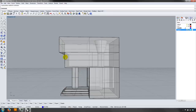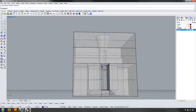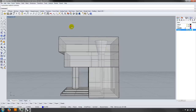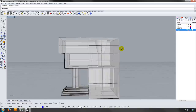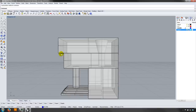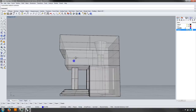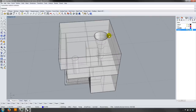Right away I'm seeing something that's going to cause problems. I can't do this in one pour because I have this positive space that runs through and ends here. If I were to pour around this, it's basically going to create a lock — a positive form that would be impossible to remove. So I know I have to consider this as a separate piece. But there's also a problem because this positive form tapers outwards and I've got this notch here. Even if I pour it upside down, this piece is going to get stuck under this overhang or undercut. The same thing will happen from the top down — my piece would get stuck coming out of this flared section.